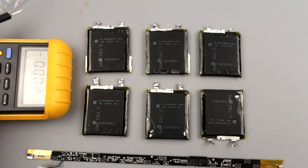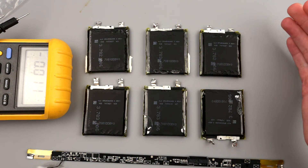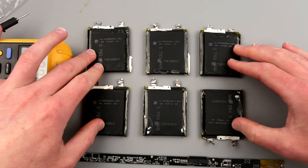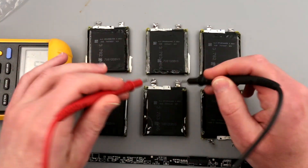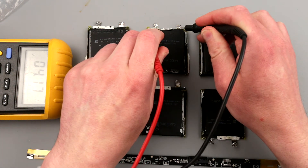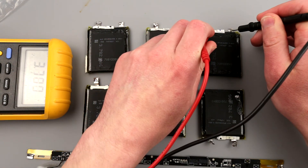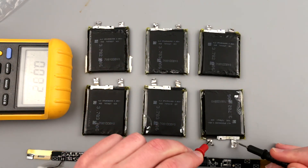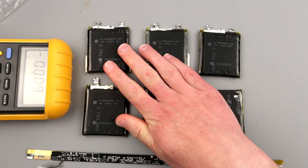In the same time it's not too far away from standard lithium battery voltages like 3.7V / 4.2V. I was able to salvage six batteries out of this pack, but not all six are actually good. As you can notice, some have 4.3V, this one 4.17V — and I'll tell you why — and this one 3.0V. Well, this battery is going down and this one reads nothing.